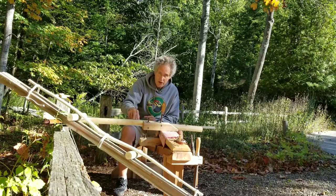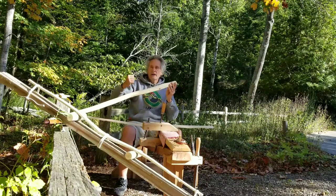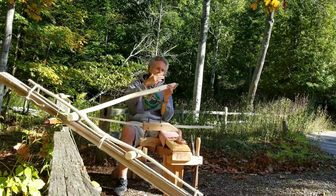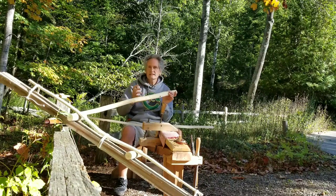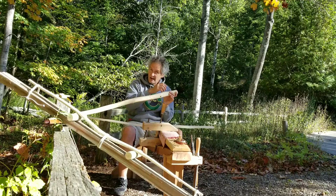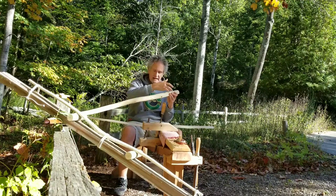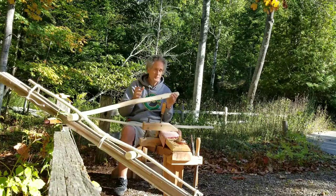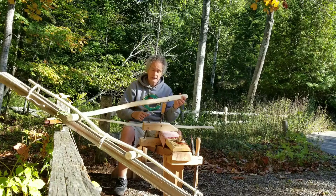With woods like elm and sometimes the maples and maybe sometimes other woods, when you go and you're happy, you cut a bunch of big round logs and you split them and you let them dry. When you come back, they're all twisted and contorted. Aha! Elm especially, the best way to handle that is cutting a line down to the center and letting it dry for a period of time before you split it into staves, which will be fun because elm has interlocking grain and it does not want to split.